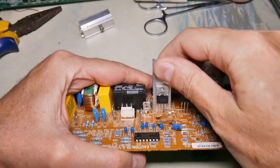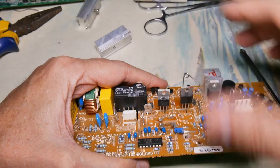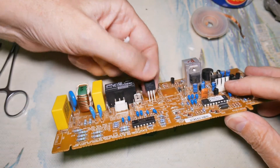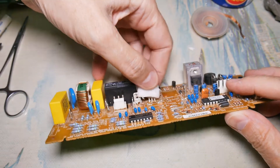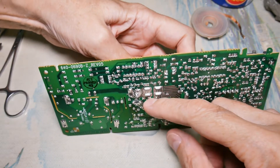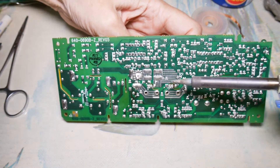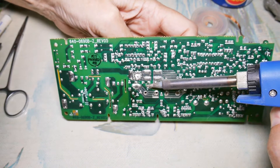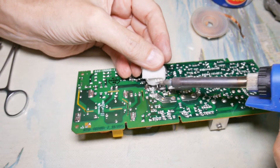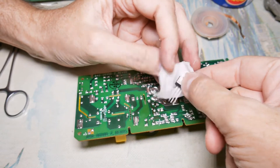For this three-legged inline component, I'm going to use a damp tissue to protect my fingers and the component. I'm going to lay the soldering iron across all three leads at the same time. You can hear the heat transfer to the tissue - and there we have it. Clean up those leads a little bit and we have a perfectly good component that we are relatively sure is not going to be heat damaged and it's ready to go.